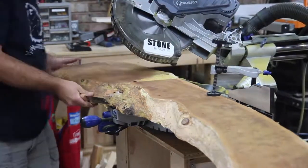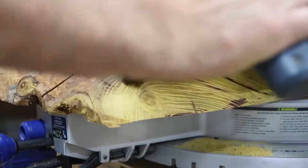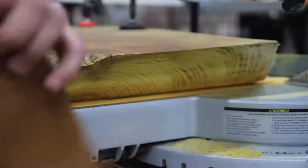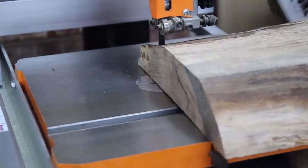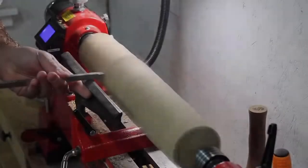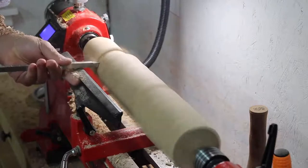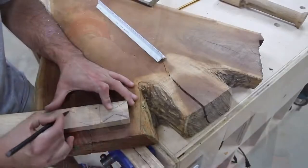The next thing I wanted to think about was how I was going to do the legs. What I settled on was dropping one side — a crop cut part of the slab — down for one of the legs, giving it a mitered corner look. On the other side I was going to make some hickory legs: a couple of turned, splayed legs. I'm turning the legs down here to a rough shape — a simple tapered leg from the middle, tapered in both directions.